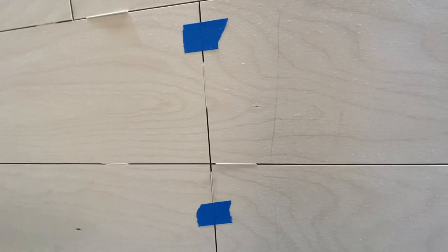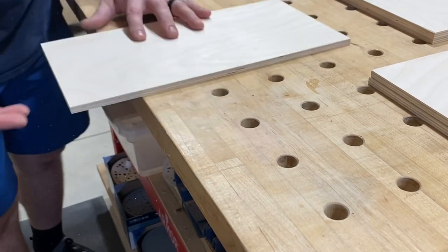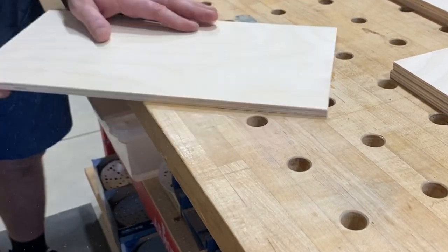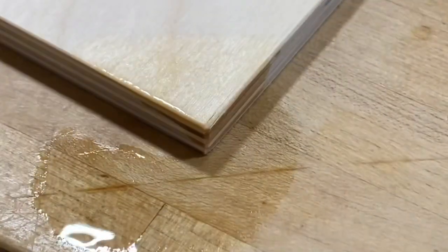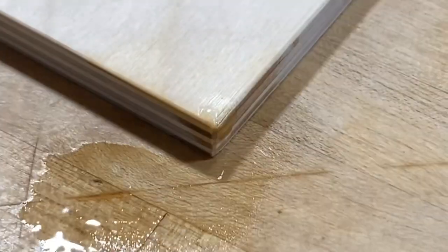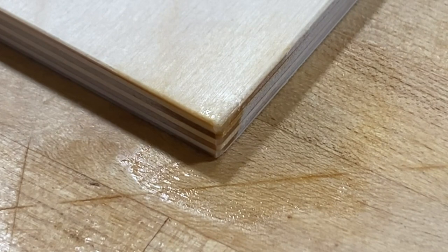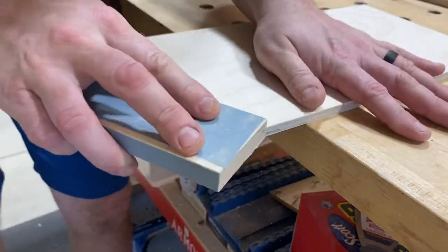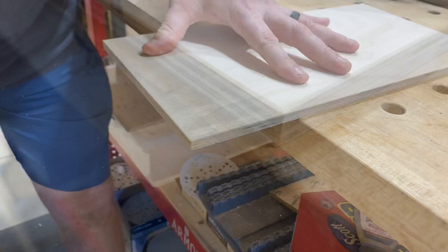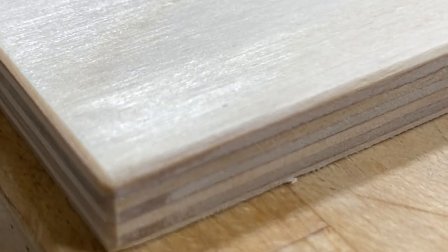You can see the plywood's still a little bit fuzzy — definitely got to do a final sanding, but I like this a lot. Let me know what you guys think. I'm really curious to see if you think that plywood can be as nice as I'm hoping it's going to be. Using a sanding block to get all the edges just right. Baltic Birch is great, but it does splinter a little bit — it tears apart just a little bit on the edges sometimes. But Starbond to the rescue: activator, glue, you're good to go. Sand it back down and it's like it never even happened. I've got my coupon code in the description.